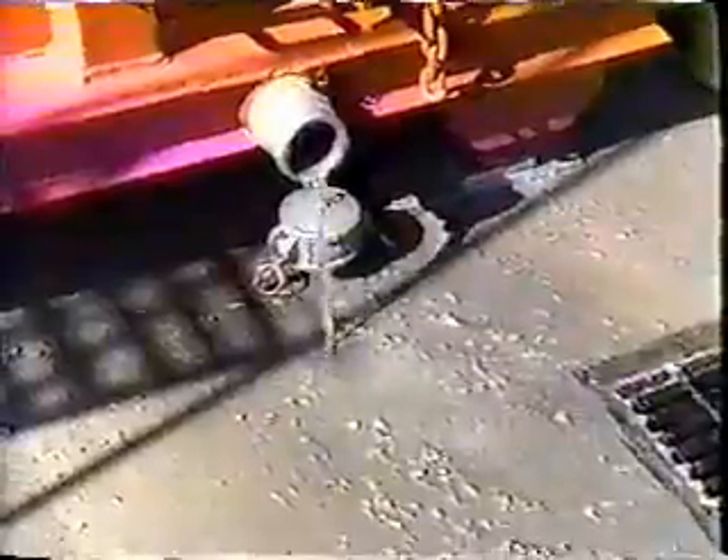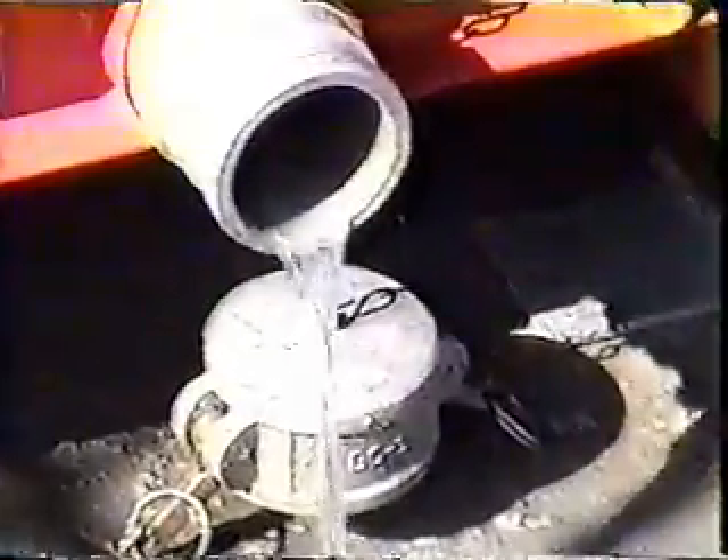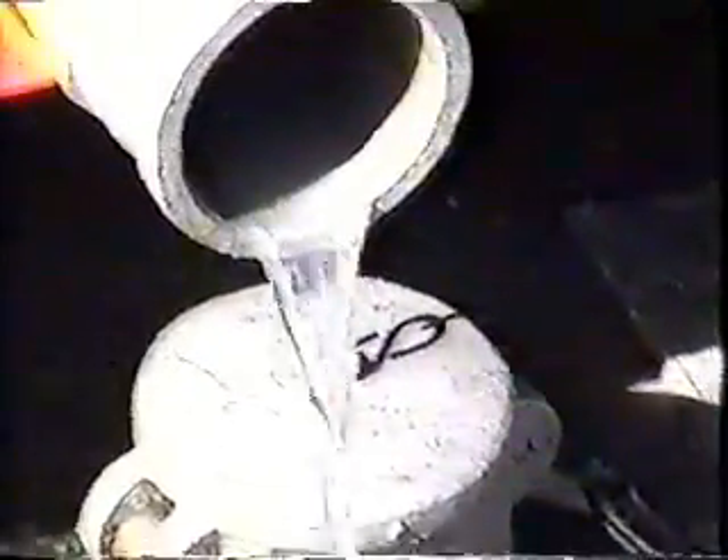Not as clear as I like it, but it definitely has a real good potential here. We've actually loaded the box and shut the pumps down. As you can see, we're just getting a trickle. The quality of the water is a lot better now that it's got a cake buildup — it's a little bit cleaner and clearer. Also, we've had better flock towards the end. You can see the cake quality.